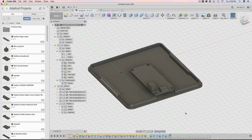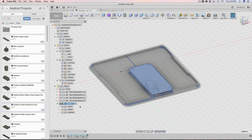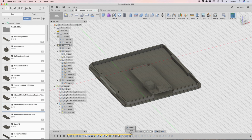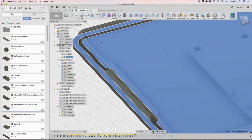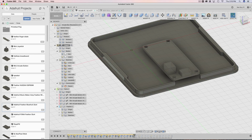It's crazy. The next thing I do is jump out of the feather component, and go back into the case. And now you can see that I create a new sketch. This is going to be the standoff. So basically what I did was I selected this surface here of the cover, and then I created the sketch. So I hit P on the keyboard, created a new sketch.